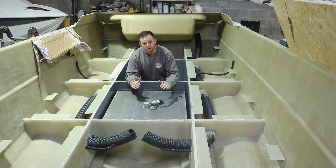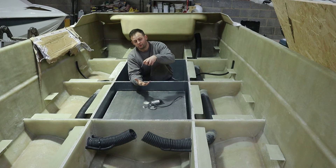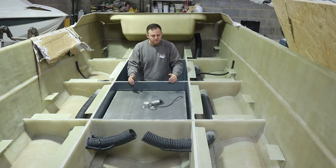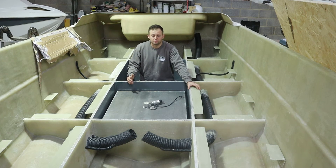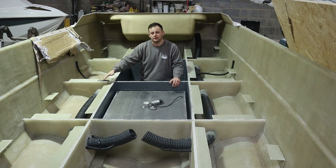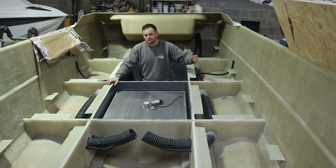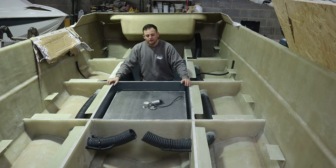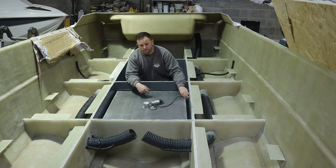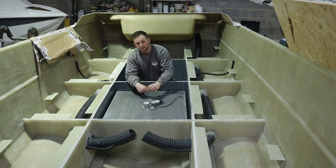This is more the Mark II version of the underfloor. We've also installed these base plates for the deck — because we haven't got a moulded skin we're making the deck boards more traditionally, so these increase the footprint of the supports under the deck, running off every bulkhead and down the sides of the hull to stop any pulling away. The boards will be laminated underneath, capped, and fibreglass-bonded into the boat structure. We've also got a small drain running through from bow to stern.